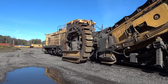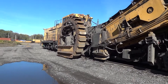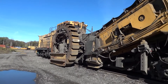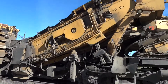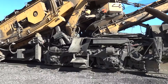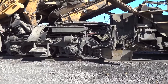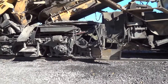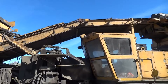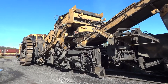This machine is designed to alleviate that. You see that big spinning wheel — it goes along and digs along the shoulder of the ballast, removing material, which helps water seep out. It dumps material into a hopper conveyor system that shakes and sorts rocks by size. Some shoot down the side, others continue on. The ones that are the right size get pushed back into place, leveled out and graded, while the rest continues through more screeners and cleaners.